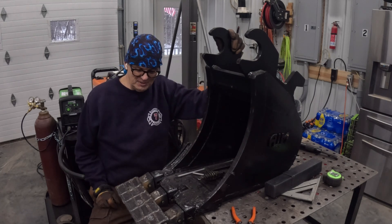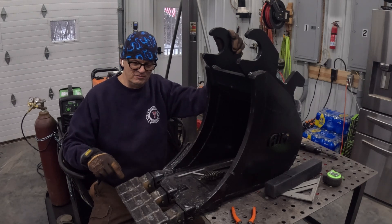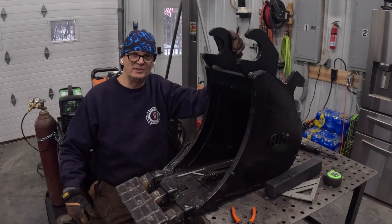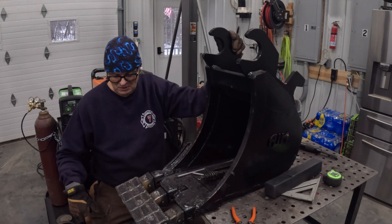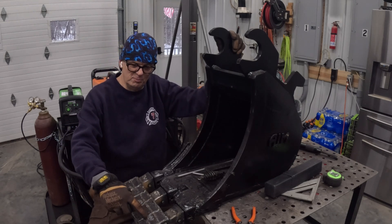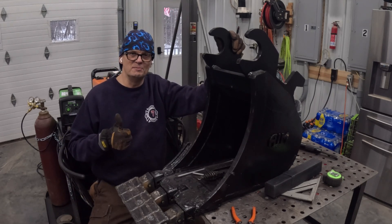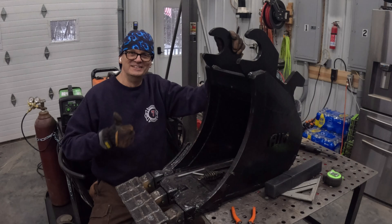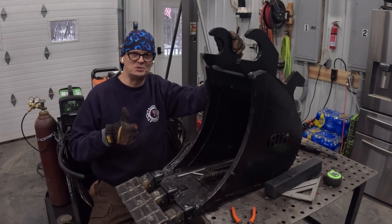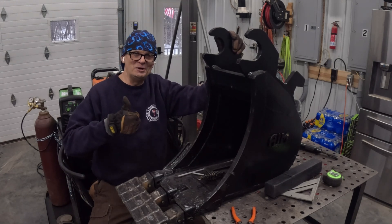That's going to do it for this project — it came out really well. I was a little intimidated about using that Blue Demon hard-facing electrode just because I'm not that good of an arc welder, but honestly that stuff laid down good and either I've gotten better or I got a little lucky. I filled in the three bolt holes that were in the cutting edge and got this all done. I think it'll stay on there and make it easier to get a smooth bottom in a trench or follow along a pipe without crushing it with one of those teeth. If you got anything out of this video give us a thumbs up — it absolutely helps the channel — and we invite you to subscribe. Have a great day and be safe.